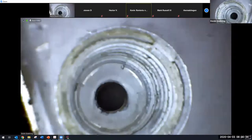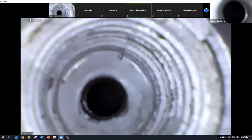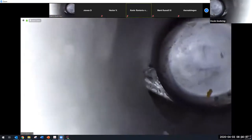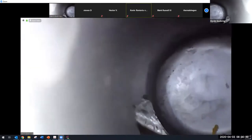All right. So fuel is going to come through here. Oh, look at that 3D. Into the swirl chamber. And then, sorry, I don't know about using this one. Hang on. I'm all tangled up. And then it's going to go down there, and there's the route to the pump right down there at the bottom. And then on the other side, you can see another hole coming in. That's return from the fuel control unit.